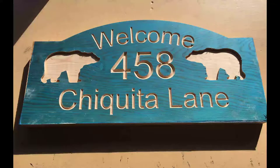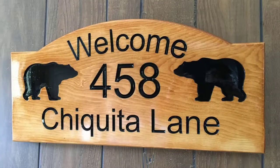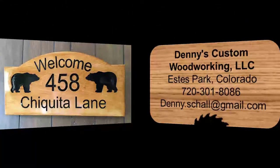Here's the sign right off of the CNC machine. The blue film you see on top is a paint mask that we've carved through. We'll then hand-paint the sign, seal it again, and after it's dried, remove the paint mask and sand it multiple times to a fine cabinet finish. Several coats of urethane are added to the sign with sanding in between, which provides durable protection against the Colorado weather. So there's a behind-the-scenes look at how we custom design, build, and finish our signs. Thanks for watching.